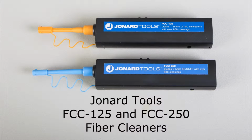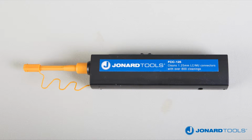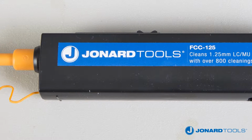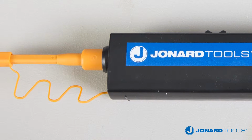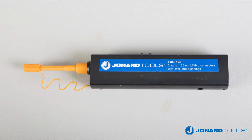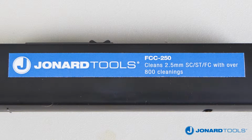The Jonard Tools FCC 125 and FCC 250 quick click ferrule end face cleaners are designed to provide exceptional cleaning performance. The FCC 125 cleans LC and MU connectors beyond the critical fiber core area, cleaning deep into the contact area of a bulkhead adapter or connectors on fiber optic cables. The FCC 250 does the same for FC, SC, and ST connectors.